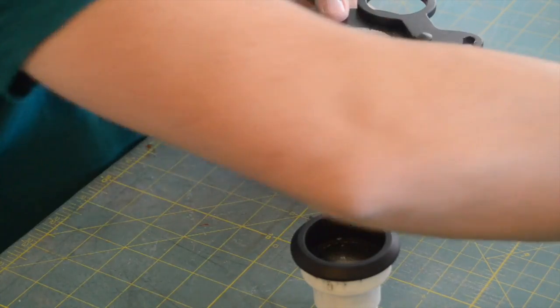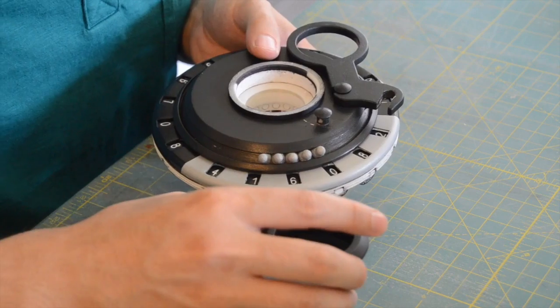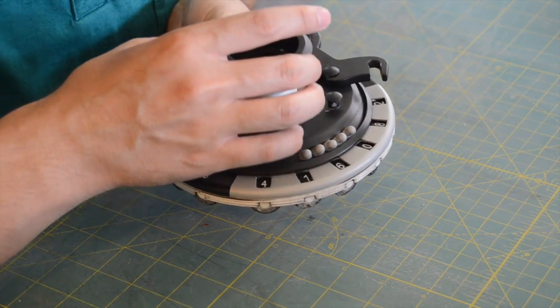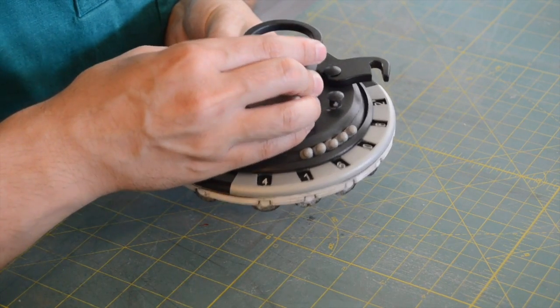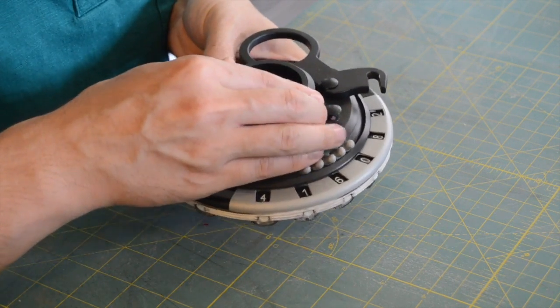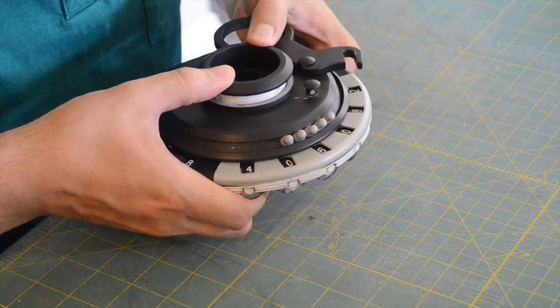Push the crank collar and spacer into the carriage and secure it with the printed nut underneath. Do not turn the carriage over to do this or the 6 mm balls may be unseated. The nut should be secure, but loose enough that the dials turn easily. If it is tightened too much, the transmission shafts may be put under too much stress.